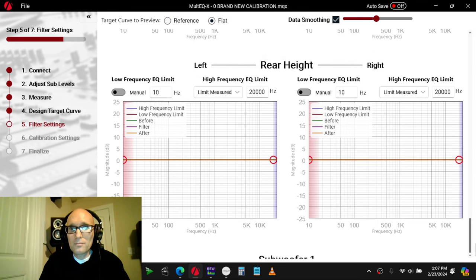So, for example, look at me doing this. I don't even need to see this. I know this is bad because the phase traces are not aligned. They're not aligned in any way. It's going to result in a bad sound, but it also shows you up here, right? It's not working at all. Everything's misaligned. So we're relatively close here, right? This is 100 hertz. This is 80. Pretty good, actually, but I haven't put any distances in the miniDSP. They're just pretty much equal distance apart. So they should be relatively close anyway, right?